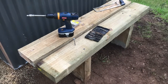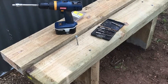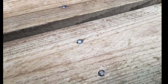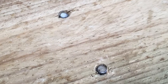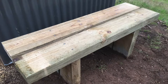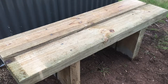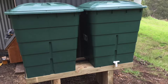I left the job overnight so the concrete could set and the legs would be nice and strong. Then it was just a matter of screwing the top onto the legs — pre-drilling the holes right through and counter-sinking them so the screws go below the surface level and won't snag on the tank. At this point you can see how this can be a bench, a seat, a tank stand, a table, or a pot stand — it's a really strong sturdy little stool.